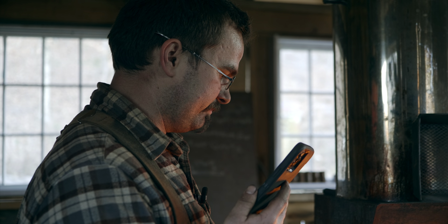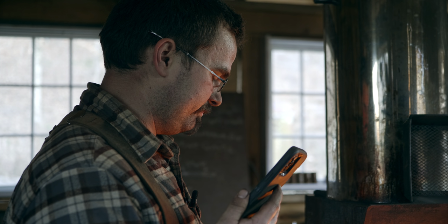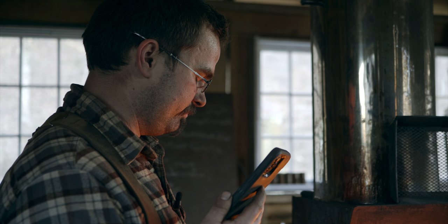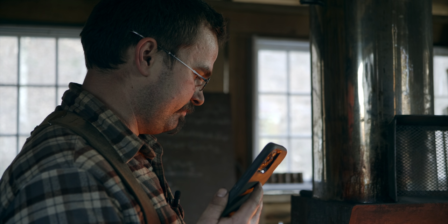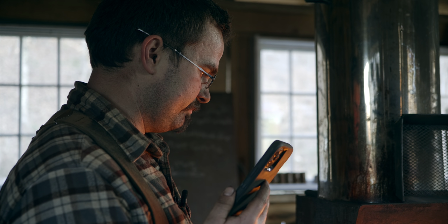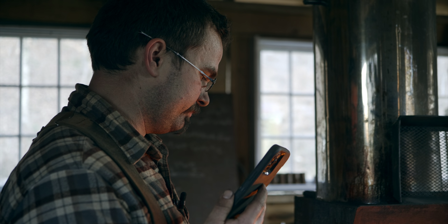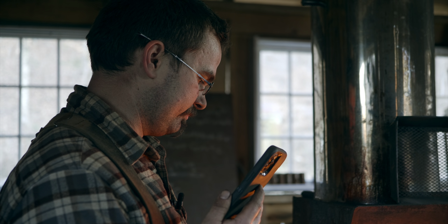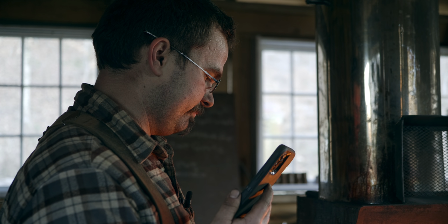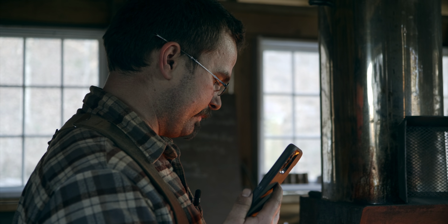Yeah, that'd be fine. Because you want to think about it like, you want enough room for the head, enough room for your hand to grip, and enough room extra for when you take it to a grinder and clean off the burrs. Cool. If you go too short, the more you have to clean up the burrs, the more steel you lose, right? Right. So give yourself a little bit. I think 8 should be fine. Cool. I think it's perfect. I don't think I'll have to trim anything off.